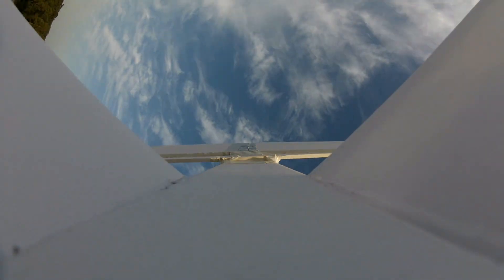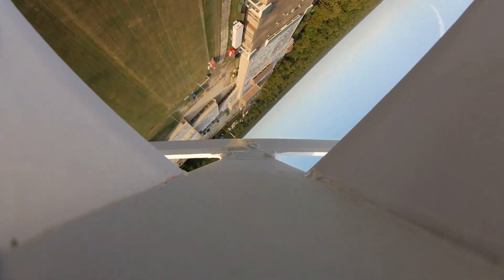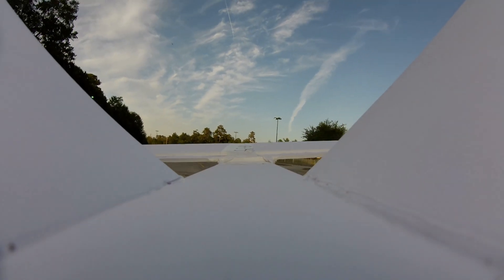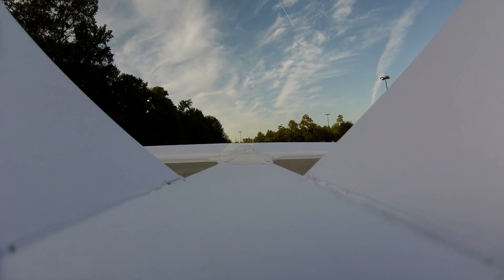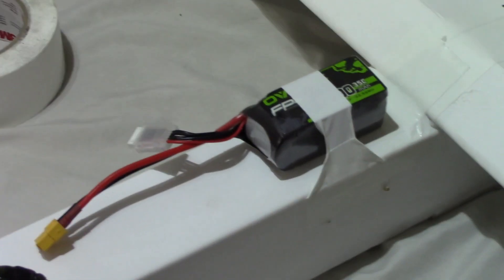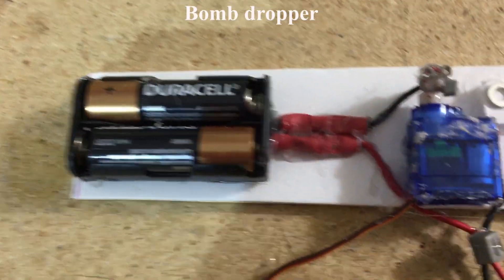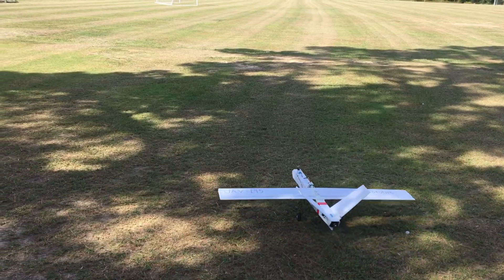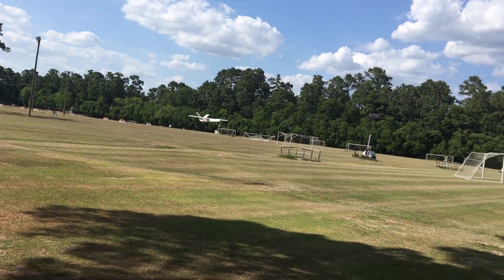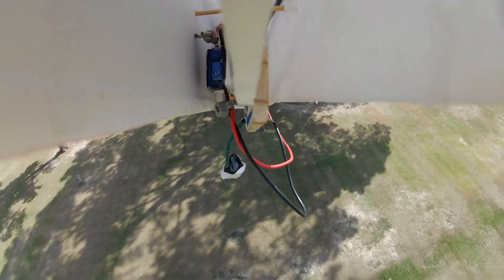After a rough landing, I had moved the center of mass about halfway down the wing, meaning the aircraft was flying very tail heavy — but it still felt just a little nose heavy and flew much better. I was so confident I flew it upside down. On the day of the main test, the plane had changed quite a lot: the battery was moved, landing gear was added, and there was extra weight. It didn't fly so great, so I removed the new landing gear because it was too much weight and went straight into the first bombing run.